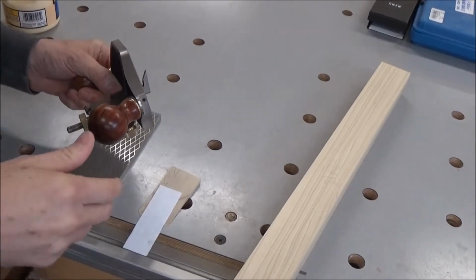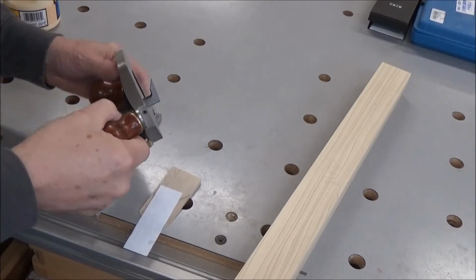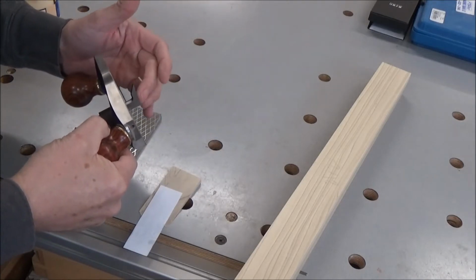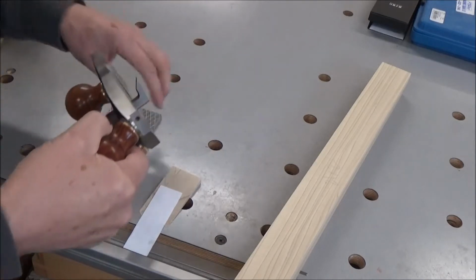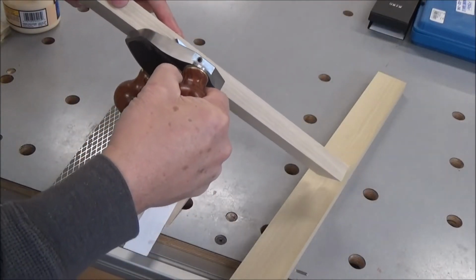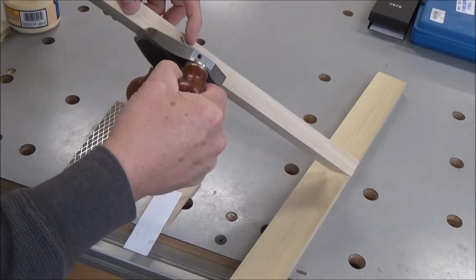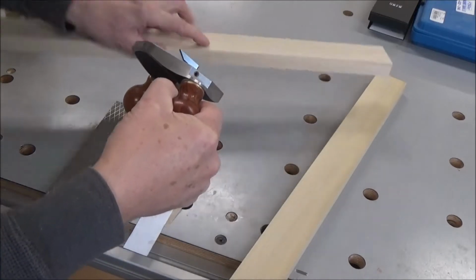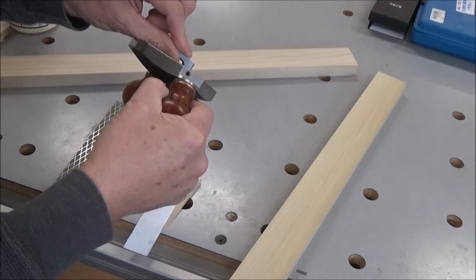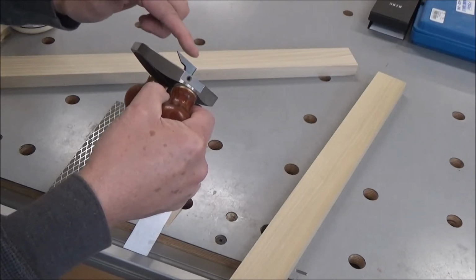They give you a little holder to hold that blade and put it in a sharpening jig to do the angle. This one, however, there is no way to hold it, but you can see that that blade is manufactured at a bit of an angle here, the base of it, and then you've got your probably 25-degree angle here to the base for your edge.